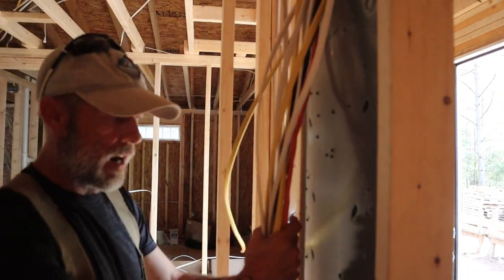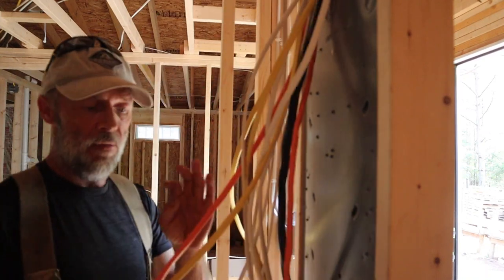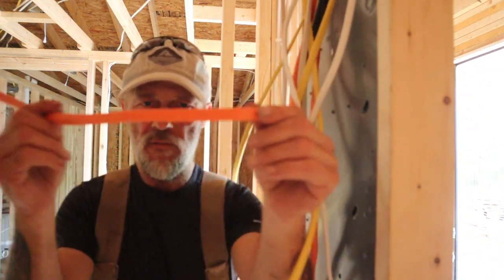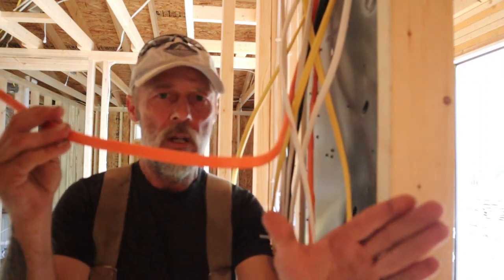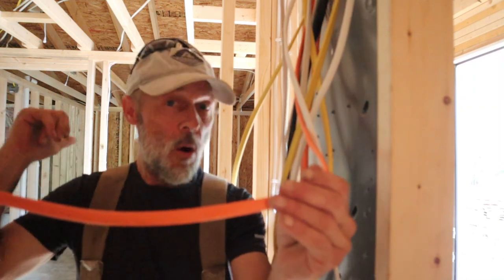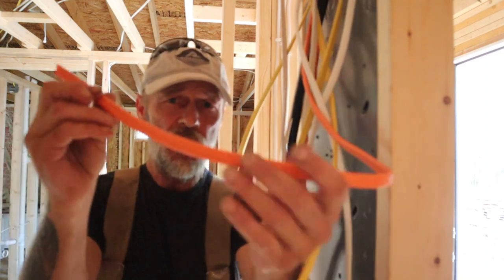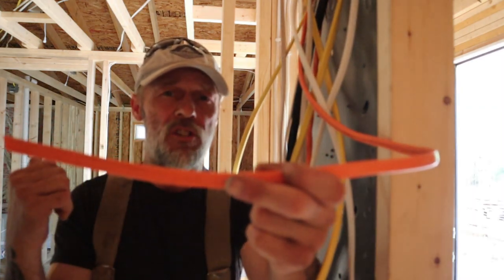Here on the back side of the electric panel inside the house, there's a whole bunch of wires from everything that's been run through the cabin. This is a 10-2, 30-amp, 240-volt wire that's ready to get hooked up to the panel. We have no power inside right now — everything, the fan, the lights, is all running from an extension cord off my other property. This tail end going into the meter box will be taken care of by the electrician.